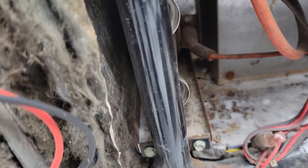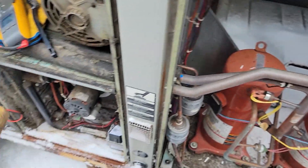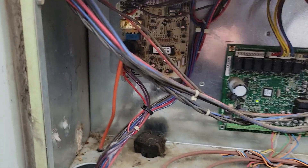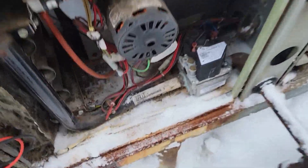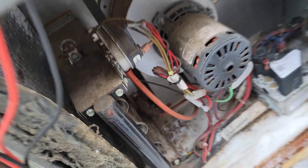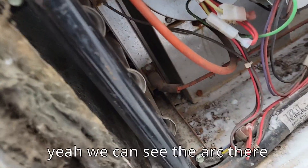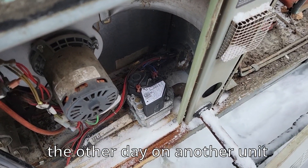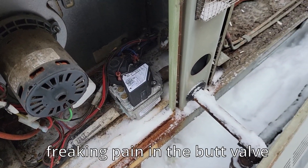The igniter — I'm usually not too worried about it, it arcs through pretty much anything. Let's try this again. Obviously it ain't just a flame sensor but we cleaned it just to be precautious — good stewards. Let's go up here and tell it to run. See if you can hear it clicking — not getting any fuel though. We can see the arc there. I just replaced some of these gas valves on another unit the other day. This one's a two-stage — that's a pain in the butt valve.